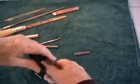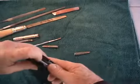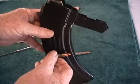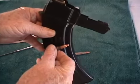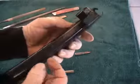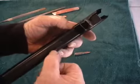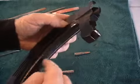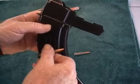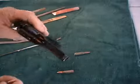The reason for this is part way down. See how they're getting stuck? I replicate it again. So here's what's happening. As the bullets are coming up, they're getting on a diagonal, and they're hanging at this point right here on this curve where they folded the two pieces of sheet metal over and spot welded it. The inside piece, we need to file it down so that as it comes up, when it gets into this first part of the curve area, the bullets have enough clearance that they can make it run on that curve. And that's what your problem is.